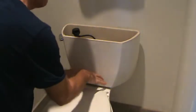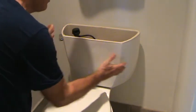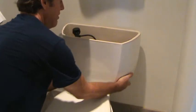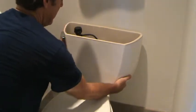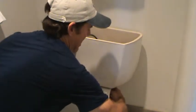Class is now in session. What you gotta do, gotta make sure that doughnut, that gasket under there is positioned properly. If you have that off, I see how this is kind of wiggly wobbly. You gotta make sure that's positioned right. You may have to tilt it forward, put it back, sideways, whatever. Because the last thing you want to do, if you're not taking care, you may tighten this one up and it might be off, let's say like that. See how that's crooked?